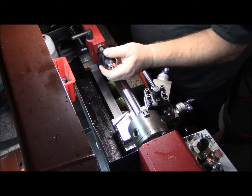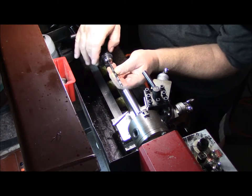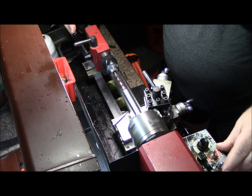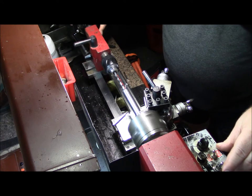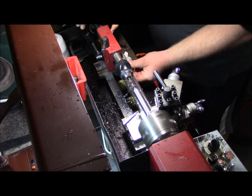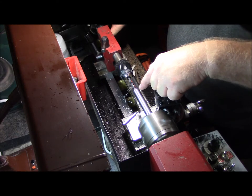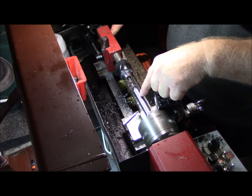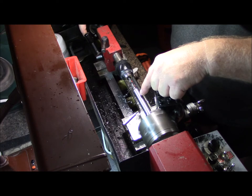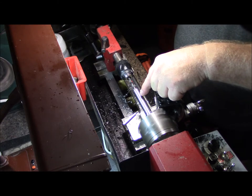My pilot hole is already drilled. I'll put in a quarter-inch drill bit. If my math is right, I'm going to go an inch and a half deep. That'll account for the five-sixteenths diameter T-handle hole, an eighth inch above that for material. If I put a one-inch spring inside and a ball bearing, I can compress it down to three-quarter inch, which will give me enough up pressure. I can trim the spring to adjust that up pressure.